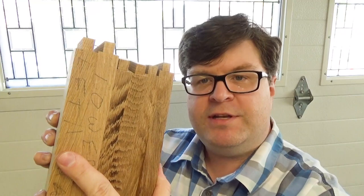I've got all the tenons cut on all of my work pieces, and I've measured them with the calipers and they're just slightly over 10mm, which is exactly what I want.